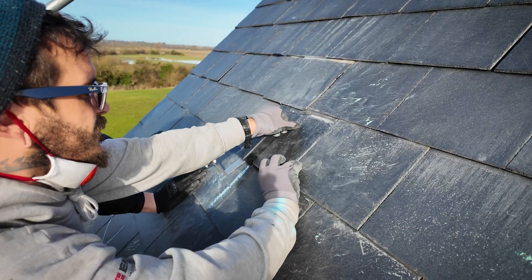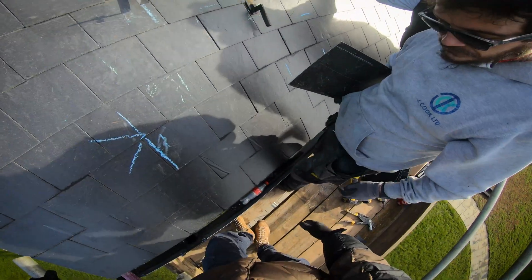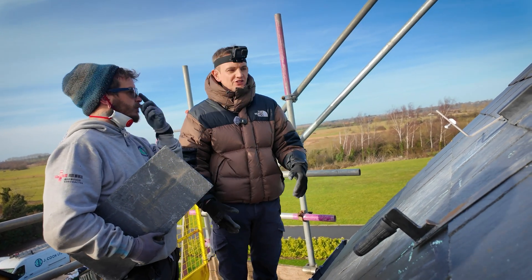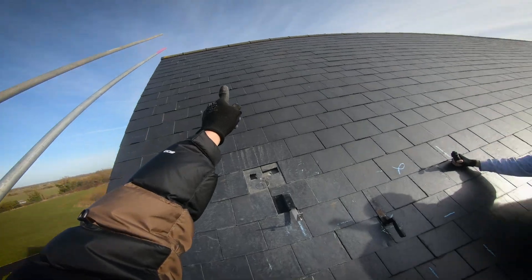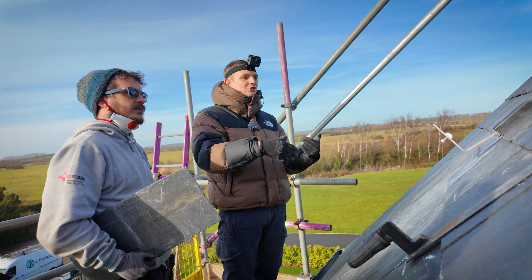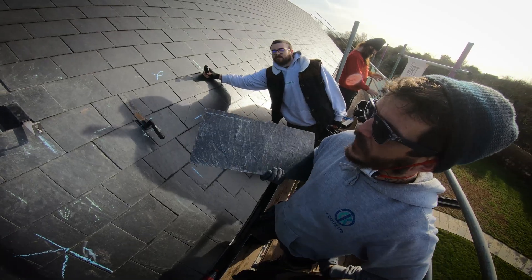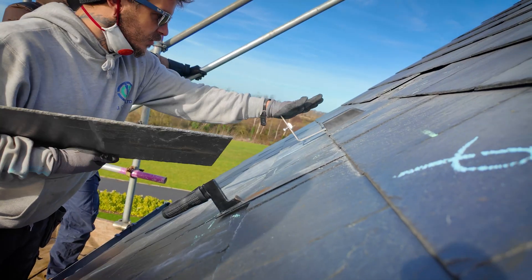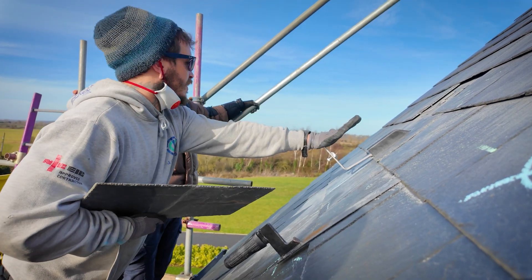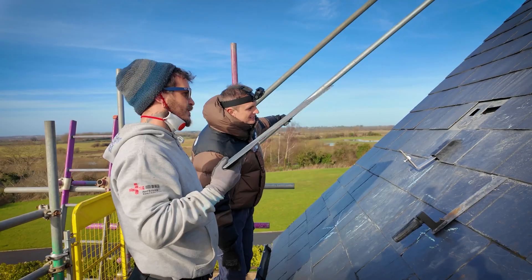This is why it takes the time. Big respect — I didn't realize it was that complicated. It's not only that either — this is sort of eye level for us standing on the scaffolding, but when you're up there and you've got to do all that... you've got to grind it, get your drill, get the ripper, get a tile, cut it — get down, get up, get down, get up. Every time you're walking on these you can't just leave the tile up there, because nine times out of ten you leave it on the rail. The rail has a bit of flex in it, something moves, the top panel sits — and then with the weight of the panels it'll come down and move your tile rested on the rail, and that tile slides down and smashes. And then you're looking for another one. That's the cost — that's the time.